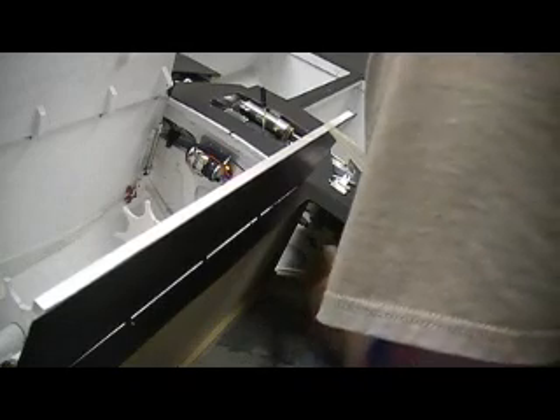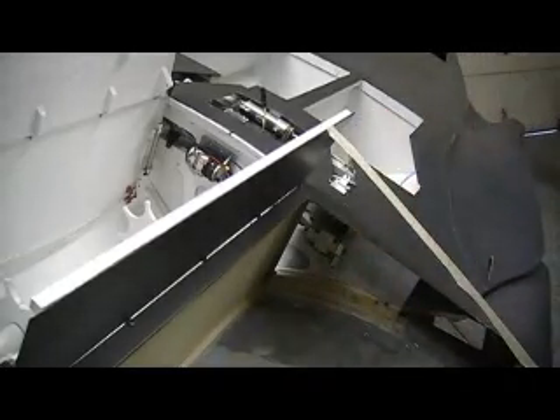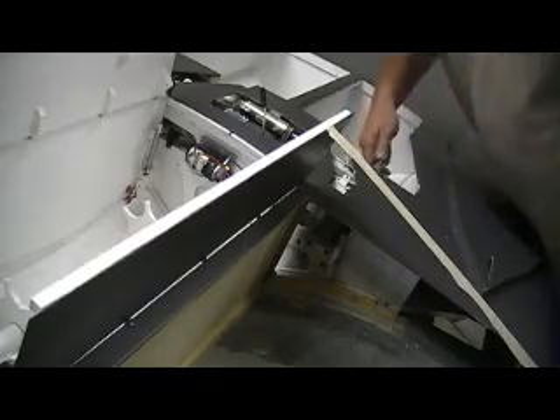I'll check it out and get her lubed up — figured you'd all like to watch because it feels kind of stiff, it don't feel right. So it's just as easy to do it right now. When I put this back together we're going to check it with some air — I think we'll be fine. When dad first built it, we hooked it up to the air tank and it didn't lose a bit of air all night long, not a pound. We ain't going to go much more than 40 pounds — that's all we really need. If it'll hold a hundred pounds of air all night, it'll hold 40 pounds of oil indefinitely.